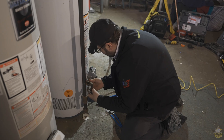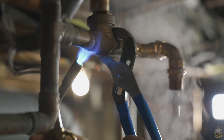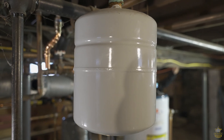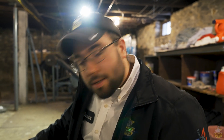There's nothing wrong with this heater other than the age of it. I was out for a leak one weekend — they had flexible hoses on top that broke and were leaking water all over the place. So I was out over the weekend, swapped that out to get it back up and running, and then gave them a price to replace the heater due to its age, replace the expansion tank because the one above us is bad, and add in the pressure reducing valve. They decided to do that and just wanted to wait about a month or so, and now we're back.